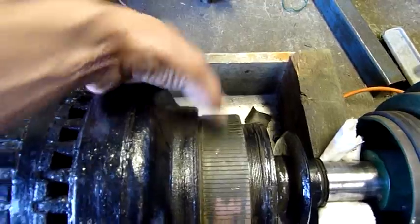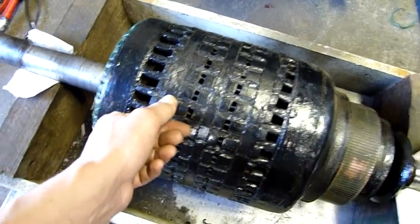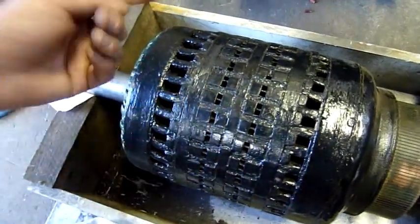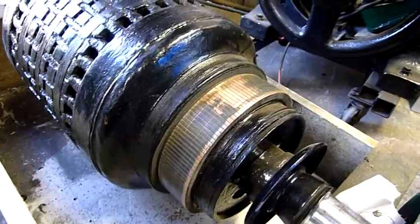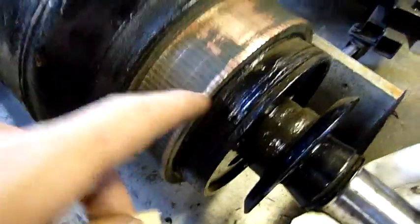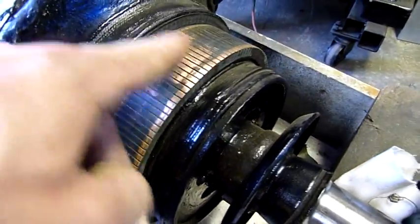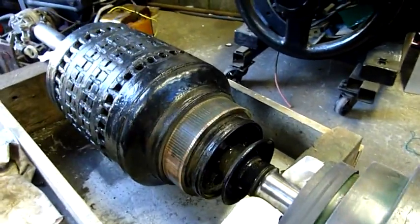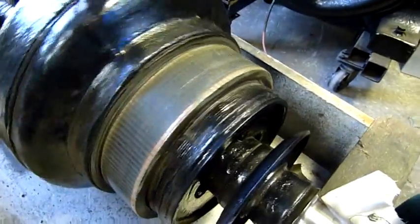The com bars should clean up pretty well — there are a few little nicks and scratches, a bit of a scratch down there, but it'll come up quite nice. It's wire-wound; this is a steel or coated steel wire, or maybe tinned copper wire, wound around it and then brazed over with lead. It's one solid armature — it ain't going to come apart. That has to be the most glazed commutator I've ever encountered. I was spinning it up pretty fast and hitting it with glass paper and everything; it hasn't broken the skin apart from where I originally tried with emery cloth. It's tough — it's been out in the weather for a very long time. I'm making a lot of dust in the process.